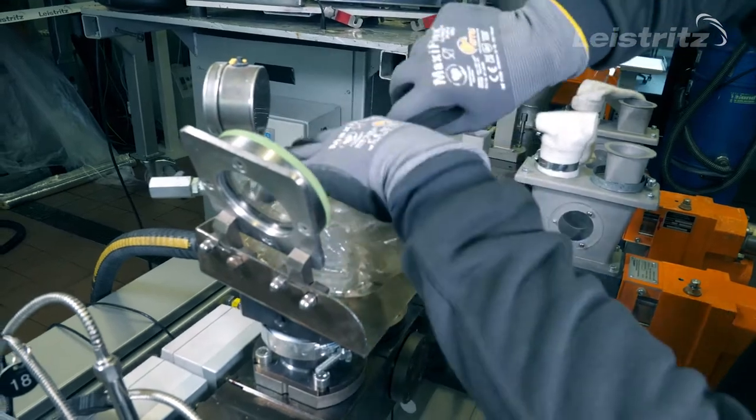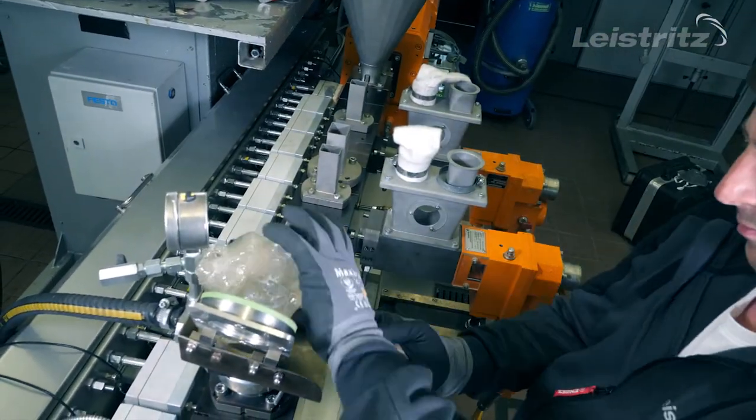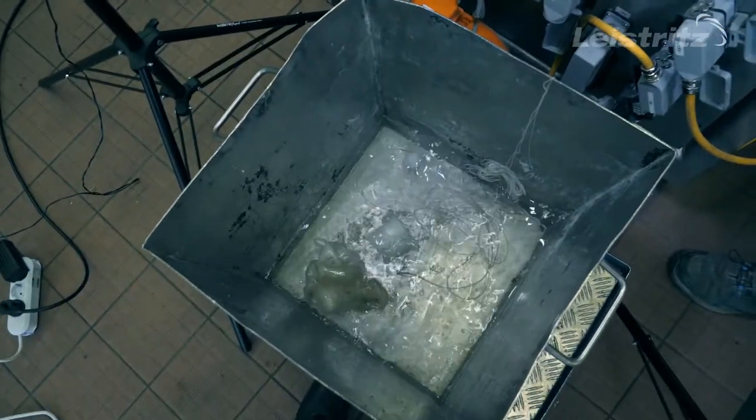For example, the material comes back from the die head because of some worn out elements. A worn out element cannot press the material enough forward. The result is material comes up from the vacuum dome.